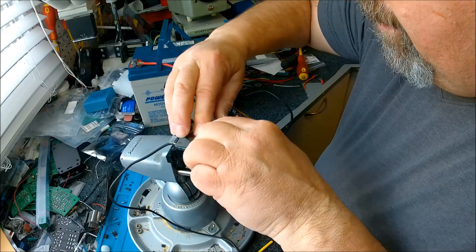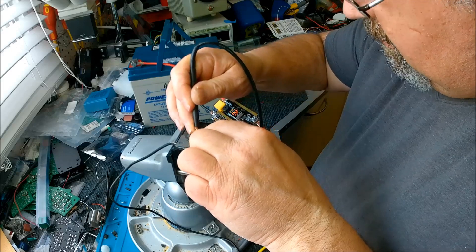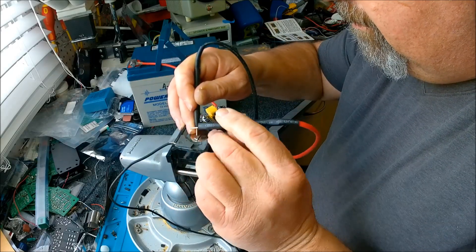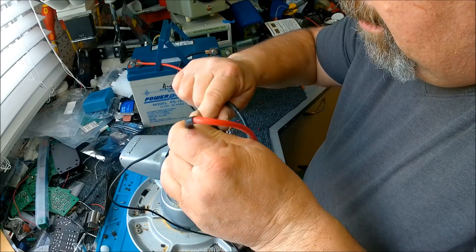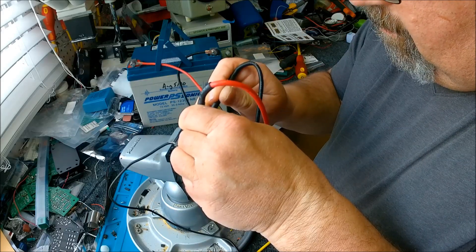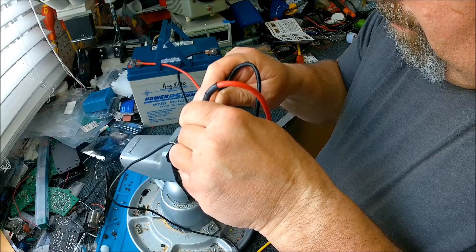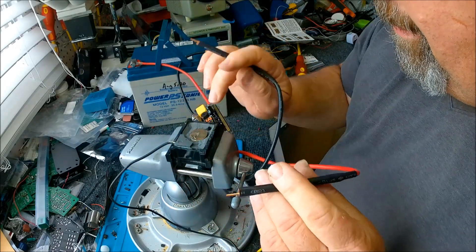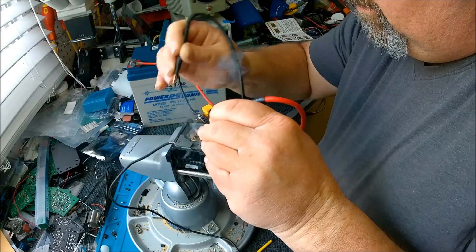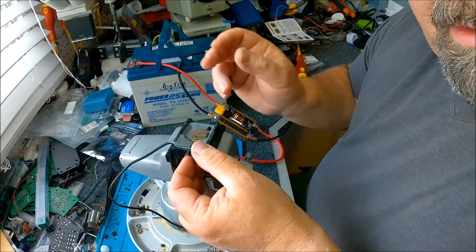This goes over top - you've got to push it hard. I've got my spot welder set to automatic with about a half-second delay. There's a little bend in here so I'm going to push that down hard first. One spot weld - that was rather forceful! Two, three - there we go. Three spot welds and they're good.